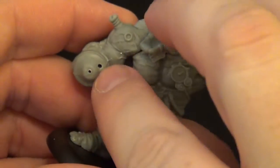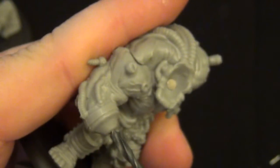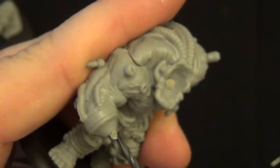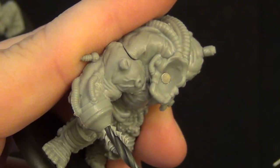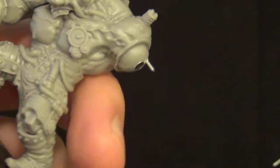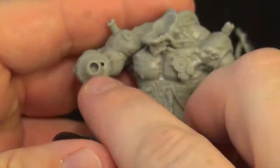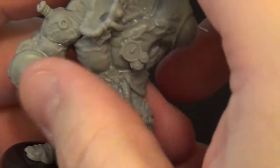We've gone ahead and drilled out that part. I'm going to show you how I positioned that magnet in. With that drill bit there, go ahead and just start cutting. Now you saw how thick the magnet was, so you need to see how deep it goes. I want to make it flush with the front of the part. I think that's probably about thick enough.